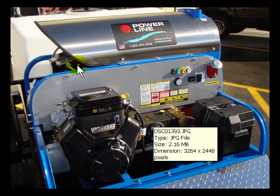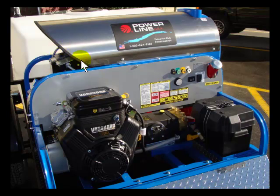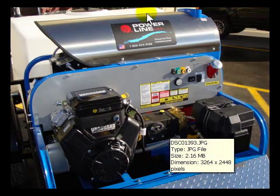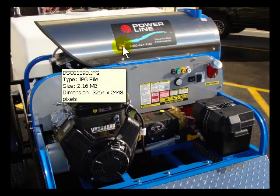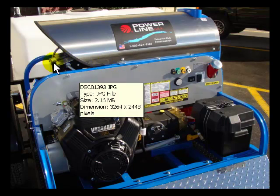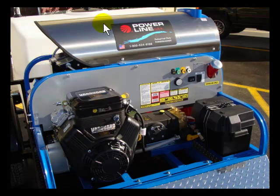Here's a little top view of the igniter. One thing that's nice about these horizontal igniters — some competitors have a vertical burner. The difference is that a vertical burner puts this piece of equipment all the way at the bottom, and if water gets in there, it runs right down into it. These horizontal ones are really easy to work on, as opposed to picking up this 300 pound coil to work on that piece.